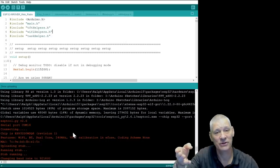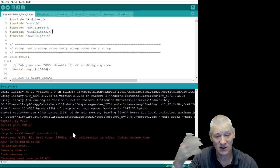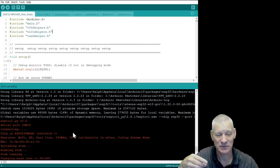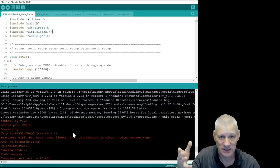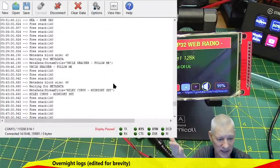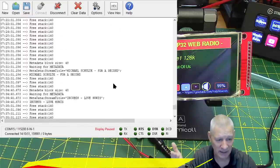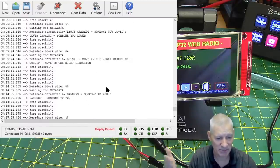I don't know if I'm going to investigate that further. The trouble is, if there's a new ESP32 core from Espressif — as there will be going forward — it's going to overwrite my hacks. So it's not ideal. I might have to go onto the Espressif forum and say, we need PSRAM to be usable in the circular buffer without all these hacks. But as you know, that's going to take weeks and months. It looks okay though — it came in this morning and it was playing quite happily.